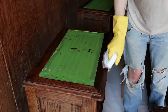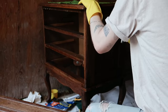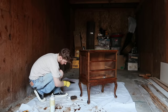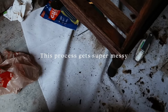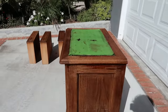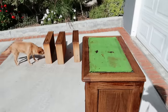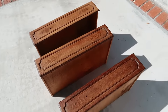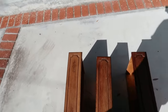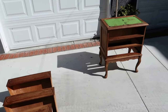The plastic scraper was my best friend for the entire process — it did a great job removing the bulk of the finish and stain that the cleaner ate off. Then I went back in with the brush from Home Depot to make sure everything was brushed, fully dry, and all residue was removed. Our furniture is lightening really nicely. I'm going to move everything to the garage and check it in the morning — I want it to fully dry completely, then see if we need a second coat.